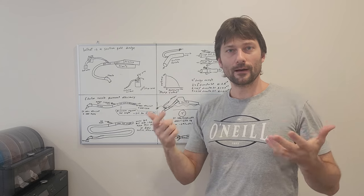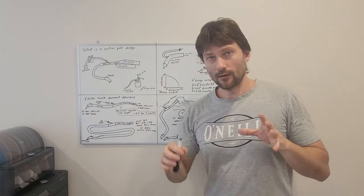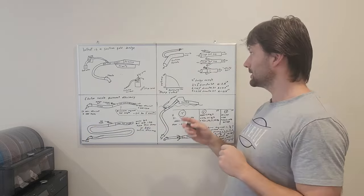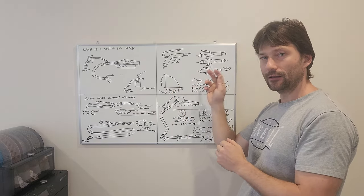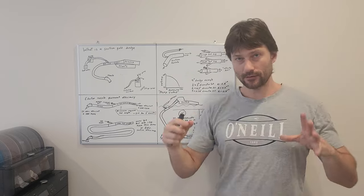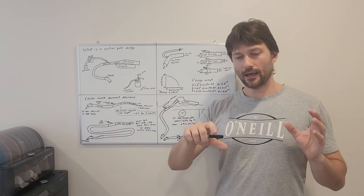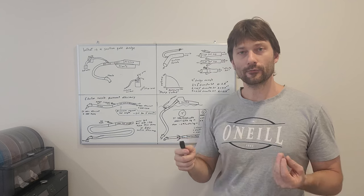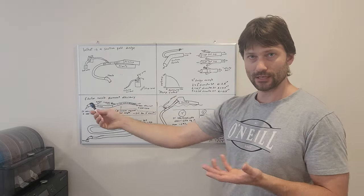You can only take advantage of this so far because you need a minimum required tail length. Right where the jet is, if you just point it at your sluice box, it's not going to fully mix — it doesn't have a long enough period to mix, and you'll just be blasting high pressure water into your sluice box without creating suction. The rule of thumb I've read is a four-inch dredge would like a minimum of four feet — a 12-to-1 ratio of tail length — in order to let that mixing occur.